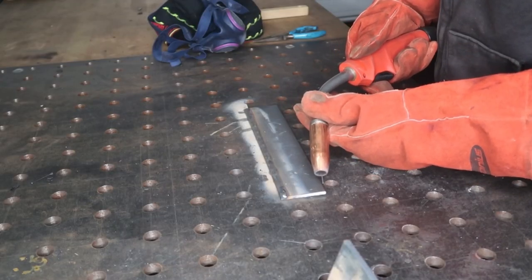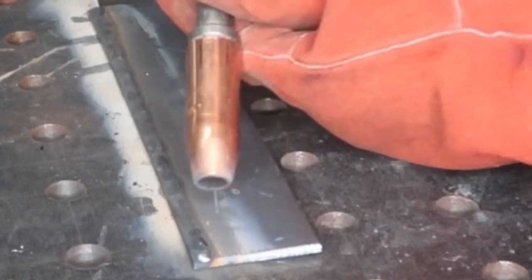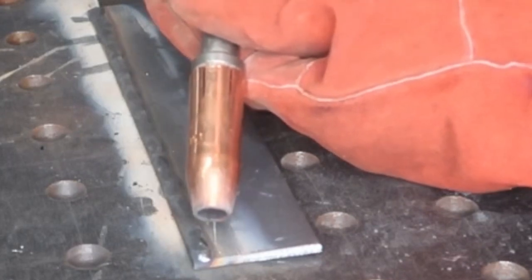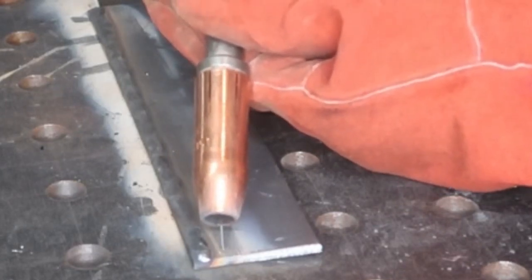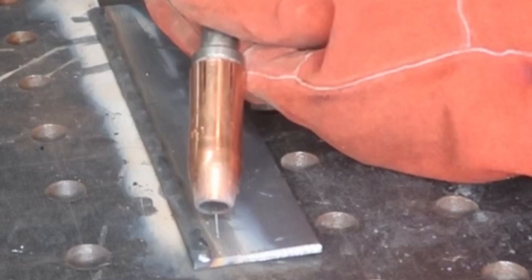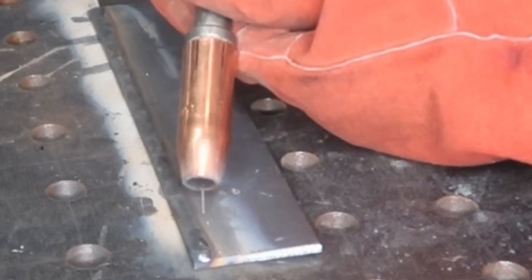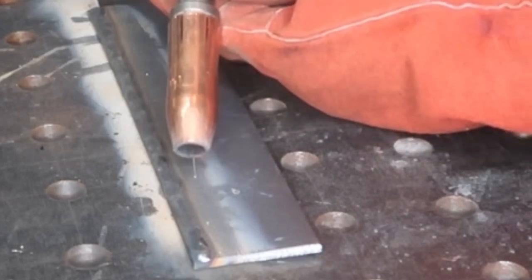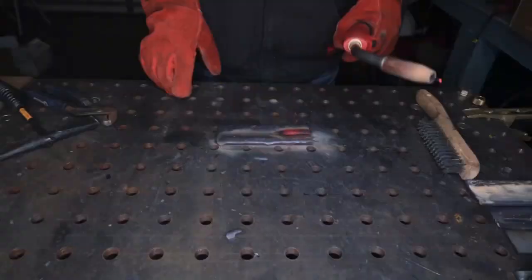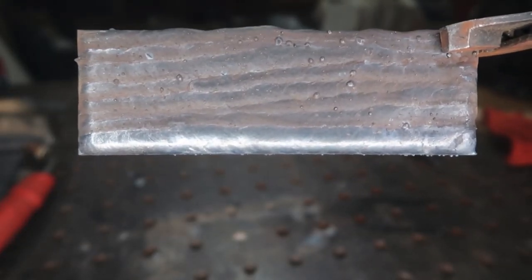You want to build up this whole edge. Where are you going to place the second stringer pass? Probably not with a long weave — you can place it here and follow the edge. What I do is I'm usually about an eighth or 3/16ths out, and I want to watch that puddle wet into the toes of the weld. I just have a nice smooth drag angle and watch that puddle hit the toes. Make sure you grab that brush and clean the slag off before you lay your second, third, or fourth pass. All this is is practice — practice makes perfect.